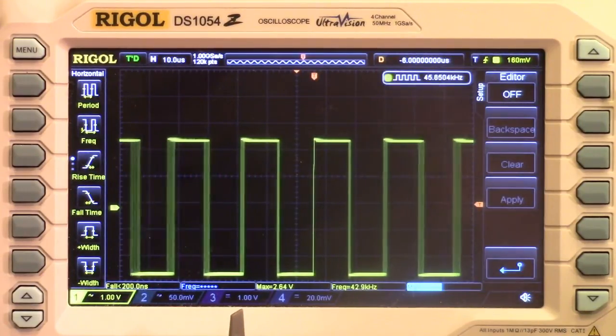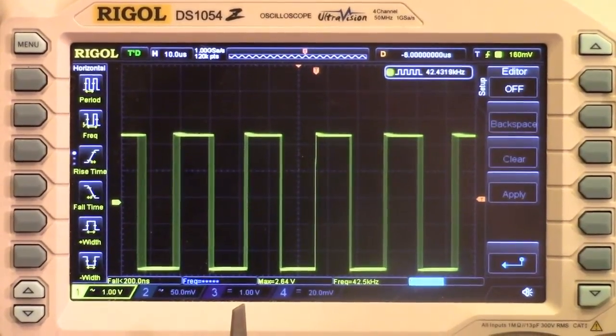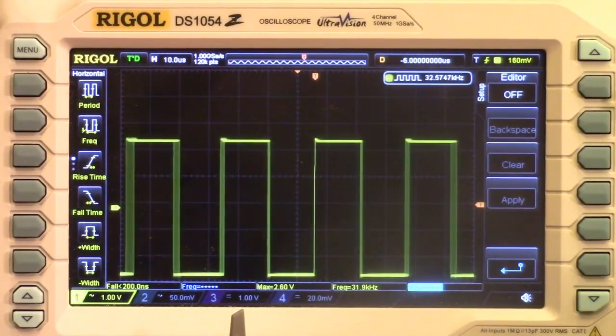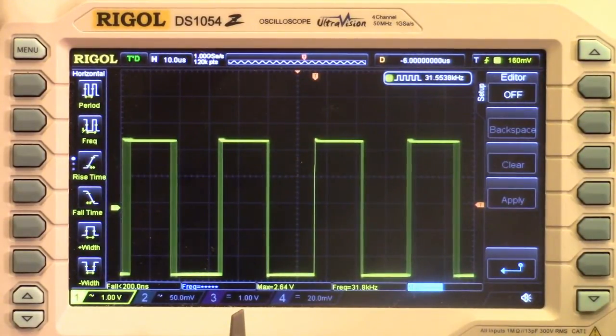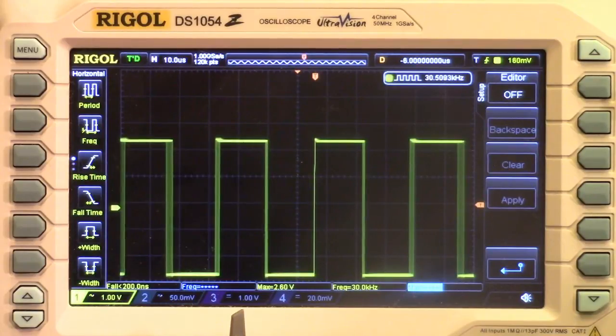And in order to do that, let me put the switches. I need to put S2 to low and S3 to high. Okay, now I've got him set to look at the group of blue photodiodes, because S3 is high and S2 is low. So that's the blue set of photodiodes. And what do we got there? Just looking at my shirt, which is kind of a dark blue, he's sitting at right around 30 kilohertz.